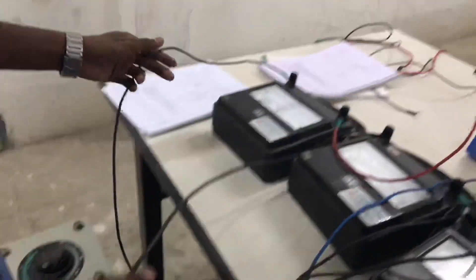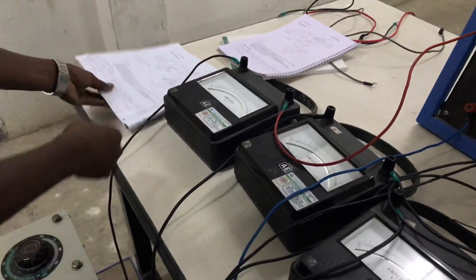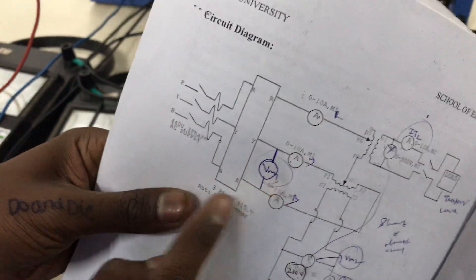The three outputs will go to different ammeters — ammeter 1, ammeter 2, and ammeter 3. Basically, the three ammeters are connected in series with each phase. You can see this in your manual. It is going to ammeter 1, ammeter 2, and ammeter 3.